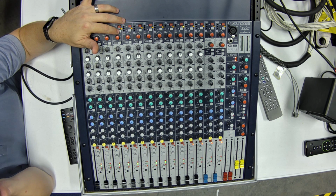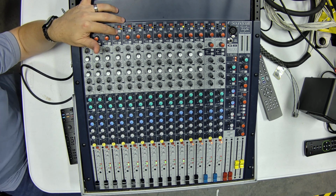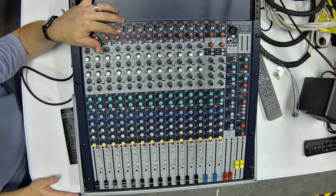Generally, it will not. It will not help you with your feedback problems, if your feedback is messed up polarity. Well, the idea there is when feedback is happening, you have this sound that's regenerating through your system. It's coming out of the microphone, coming out of the loudspeaker, coming back into the microphone, and doing that trip. Eventually there will be a certain frequency that will lock into a certain phase relationship and start reinforcing itself and building and building and building. It gets carried away and you get this one big squeal that comes out of the sound system.